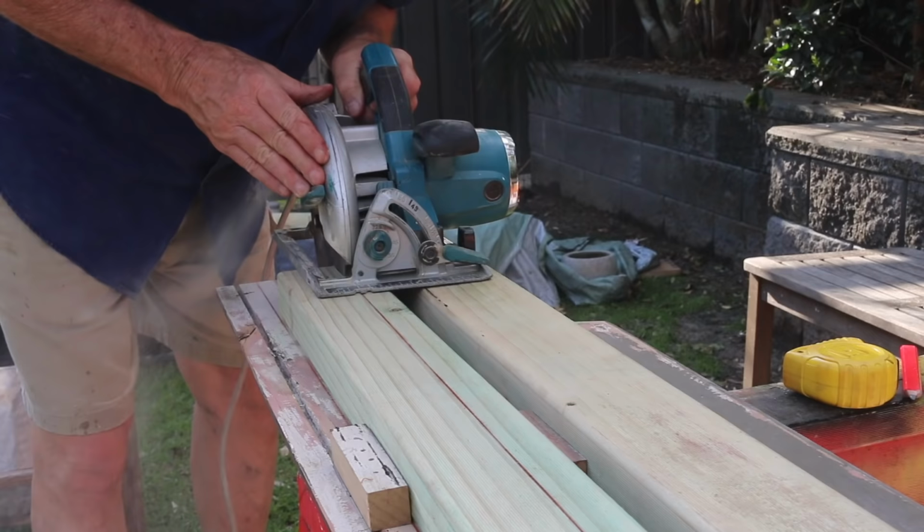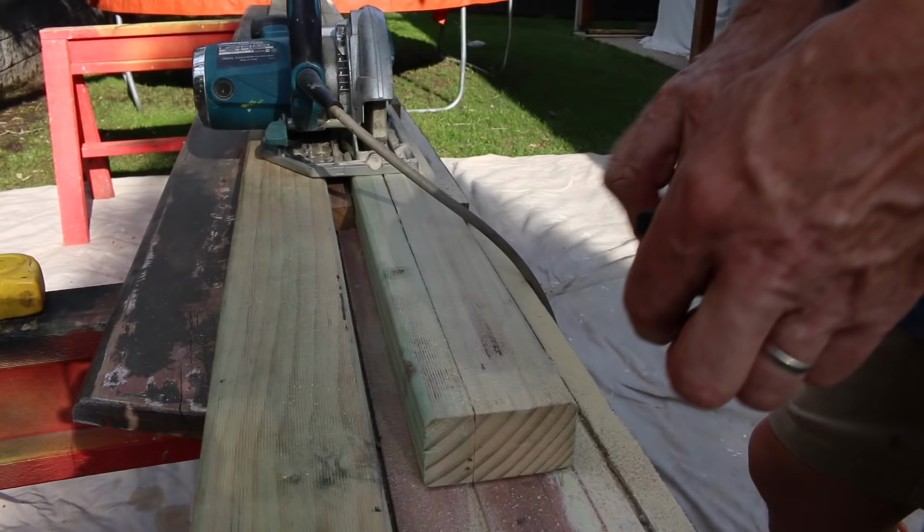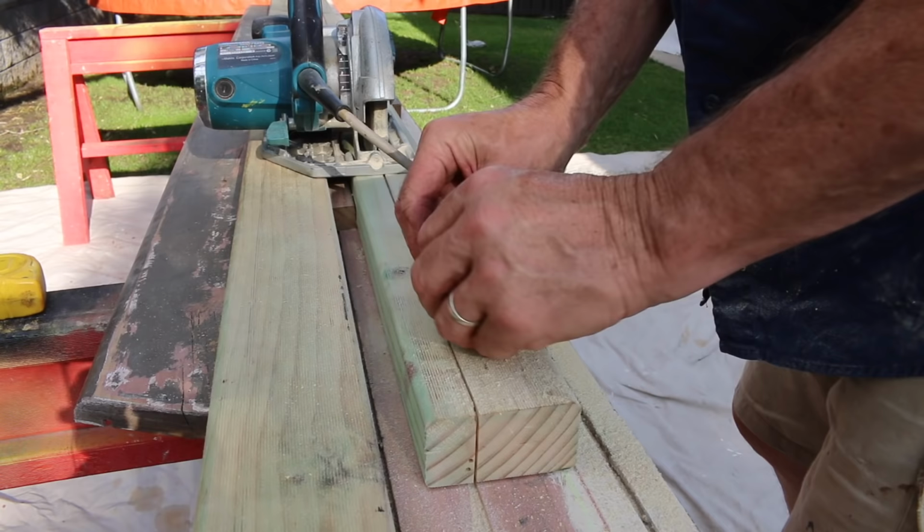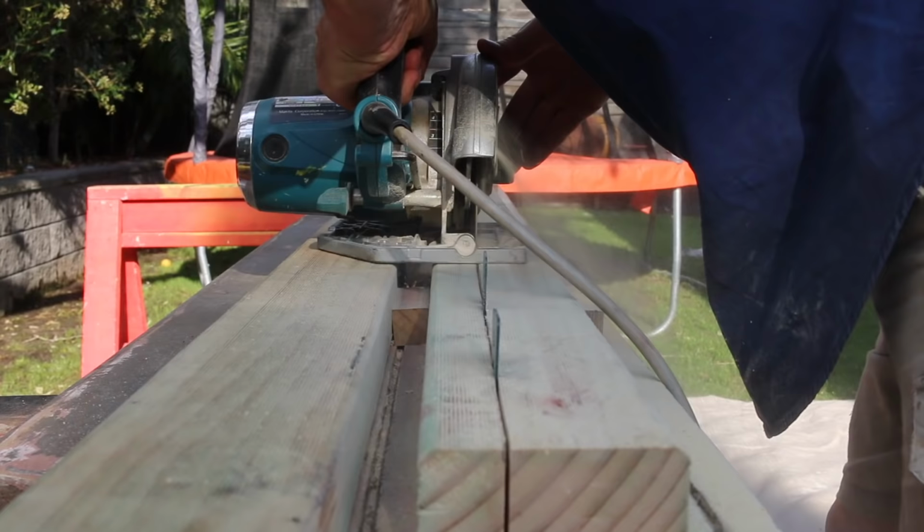Time to cut the taper, and with the joist squeezed in between the blocks on either side, the cut will tend to close in on itself, making it hard for the saw and potentially causing deadly kickback. So to prevent that, just place some small wedges in the gap behind the saw to keep the cut open, and away you go.